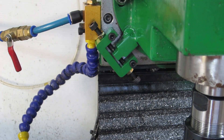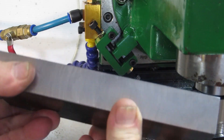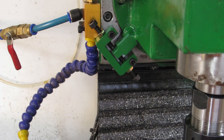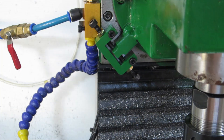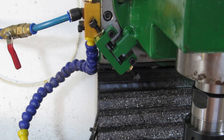I think I've been watching too many Inheritance Machinery videos. I was having so much trouble trying to realign this head — I thought I had it right, and then when I ran a cut across it I got pretty much the same damn result as before. So I decided a side project was in order: I'm going to put the fine adjuster on here that I meant to put on when I built the thing and never did. Also in the Inheritance Machinery vein, I'll have to create a box of shame, because the first one I made belongs in the rubbish. Now that I've finished that and spent a day and a half messing around with it, I'll have another crack at re-tramming in the morning.